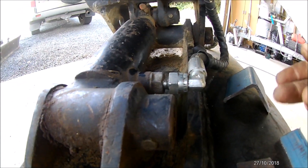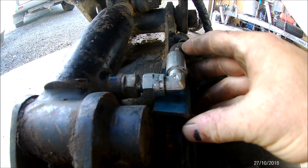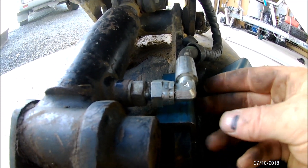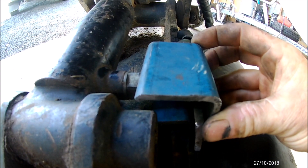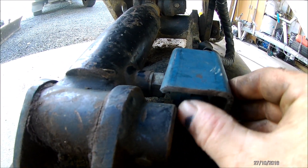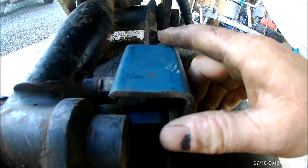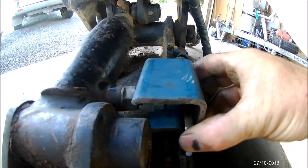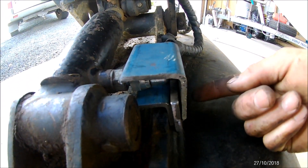Alright, so I've got something figured out. I want top and bottom protection, so I've got this piece here — it'll go under there — and I'll have a spacer, and then this piece can sit over the top. I'll weld up this end so it's a solid block and it can't really bend. I'll clean it up and leave it square, and I may do something heavier on the other side just to help it.